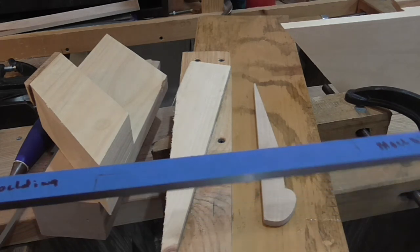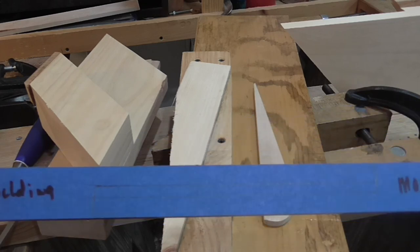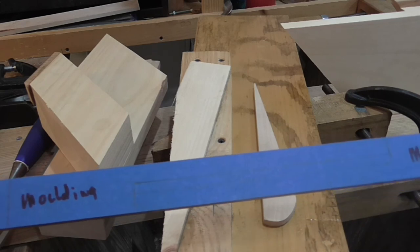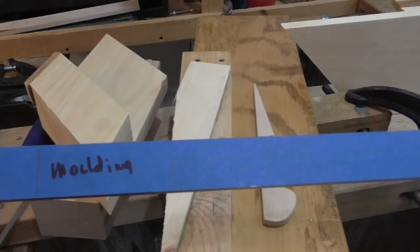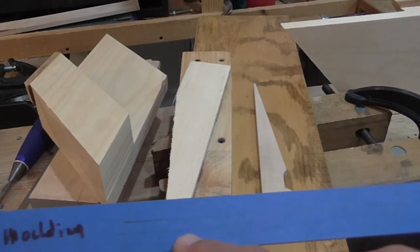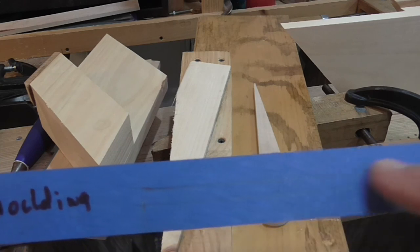It's the most efficient way of using the steel. If money was no object, I would just whack it at 9 inches and take it out, and then I'd have a whole bunch of waste and I just toss it or whatever. But I'm able to actually get quite a bit more by doing it this way. It is a pain in the neck though, because you have to get in here and, without overlapping these cuts, you have to make turns.